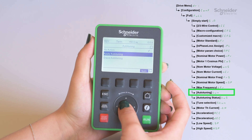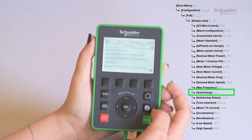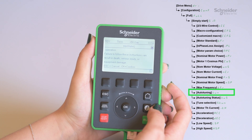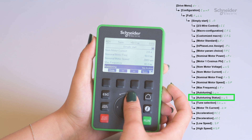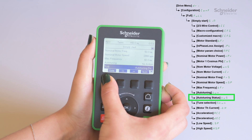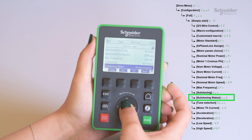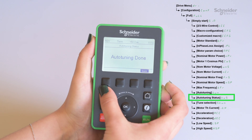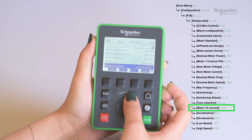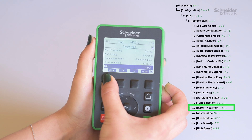This will create a small noise in the motor, which is totally normal. If you modify the value of one or more parameters after having performed auto-tuning, the value of auto-tuning status resets to not done and you must re-perform auto-tuning. Configure the thermal monitoring current of the motor/pump, motor TH current, ITH.